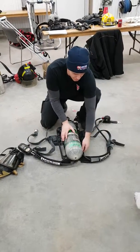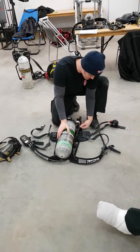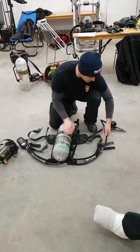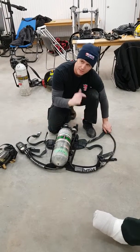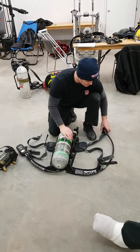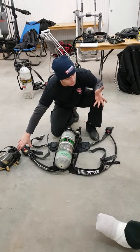Now I'm going to go through the hoses on the system, making sure all my connections and hoses are in good condition, there's no leaks. I can do that by feeling — can't feel any leaks. I could possibly hear them, listening for that hiss. If I suspect a leak that I can't hear or see, I'll take soapy water, put it in the place where I'm suspecting the leak, and if it bubbles, I know I've got a leak.